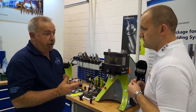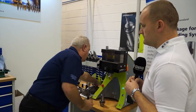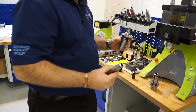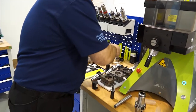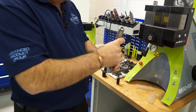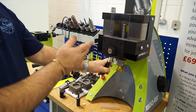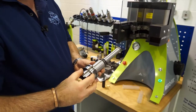We can also reduce down, because I know a lot of people say the advantage with heat shrink is the small nose diameter so they can get into deeper areas. We can offer that by means of extensions. For example, that is a PG-15 so it's a much smaller nose diameter, around about 24 millimetres. Or we can go down to the PG-10 which is even smaller. So we could Power Grip that extension into this holder, taking the PG-25 down to a PG-15 with a much smaller nose diameter.